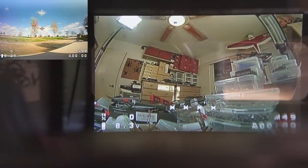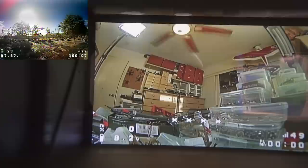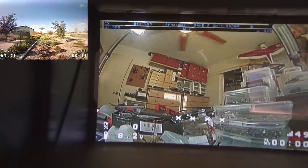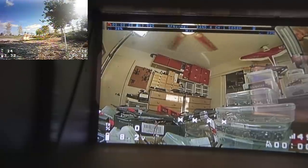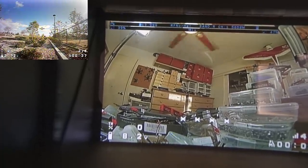Now I'll show you the image and menus. The two lenses form an image for each eye. For the DVR, you need an active video signal — press the DVR button once to bring up the OSD, press again to start recording. You can see the timer in the upper left. Press DVR again to bring up the OSD while recording, then press DVR again to stop.